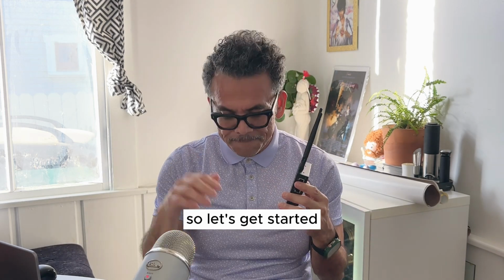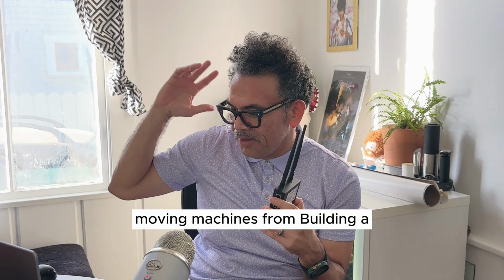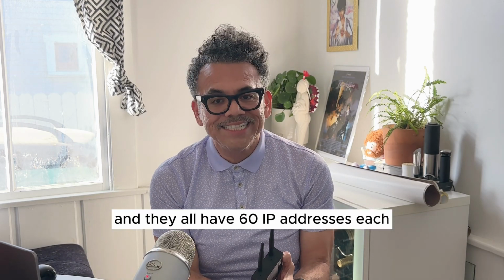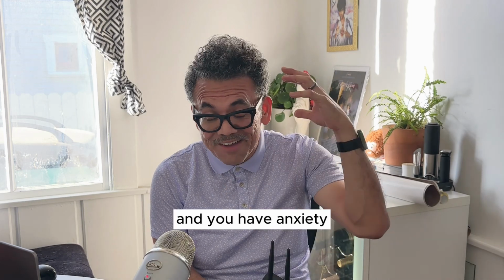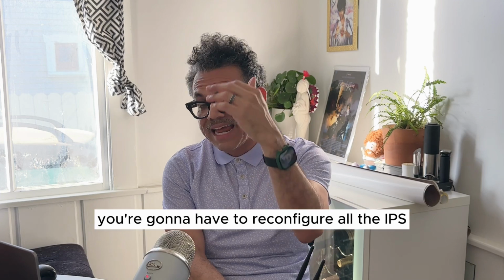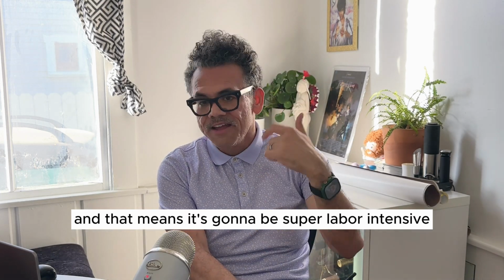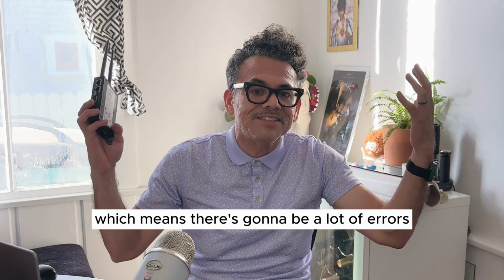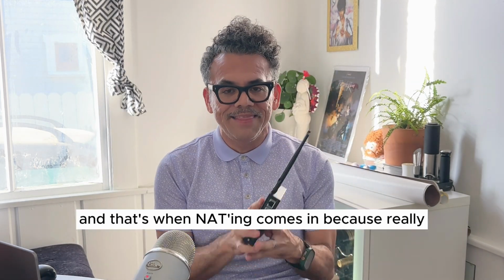So let's get started. Let's say that you are trying to consolidate equipment and you're moving machines from building A to building B, okay? You got 38 machines and they all have 6 IP addresses each. If you've done this before, you're already having a panic attack because you already know what's going to happen. You're going to have to reconfigure all the IPs on that machine. You're going to have to reconfigure all the IPs on the PLC, and that means it's going to be super labor intensive, very time consuming, and there's a lot of risk involved because of all the IPs that you're going to reconfigure, which means there's going to be a lot of errors, and that's going to make it take longer. So that means more downtime, and that's when natting comes in.